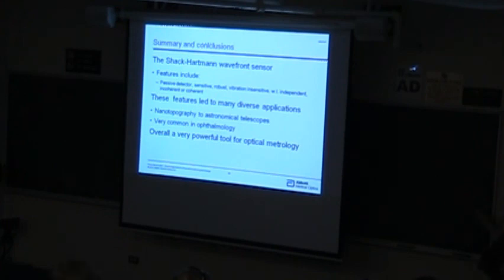Our lenses are also designed to be on the CCD side of the camera. And since they're designed on a computer, we picked the optimal design for that lenslet. So it's not a simple curvature. You have to have a square root to describe it even. It's aplanatic. It's the optimal surface for that shape. But they're usually very slow, so it's not very different from a plano-convex lens. These things are like f/28 or something like that. They're generally pretty slow.